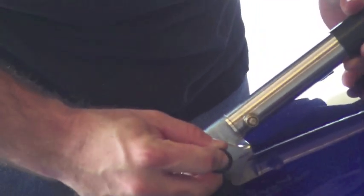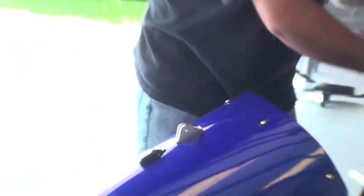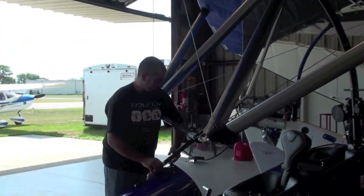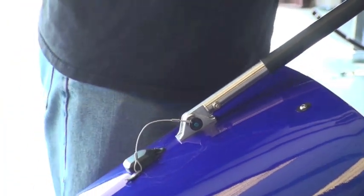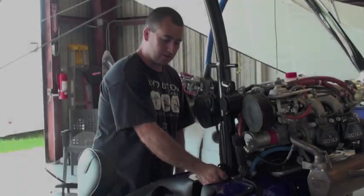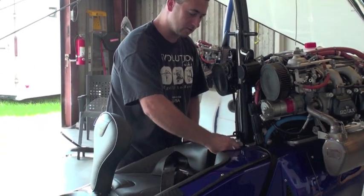With the folding compression strut, it allows you to just put it in tension-free, and you can see I can put this where it needs to go. But more importantly, we need to put the control bar on the outside of the compression strut. We're going to put this junction back together again, that easy. We're going to fold this out straight and then lock this. You're going to turn this, it just unscrews, it's a big half inch bolt that anchors this.